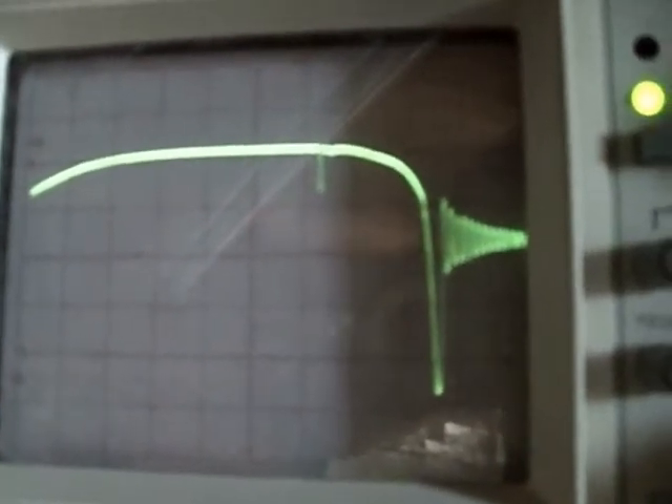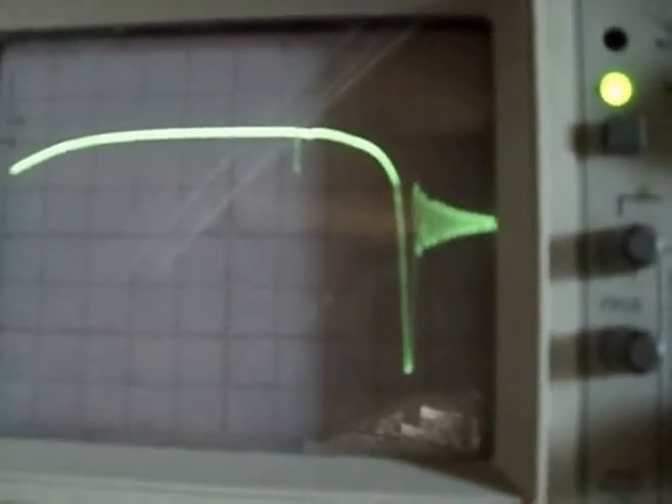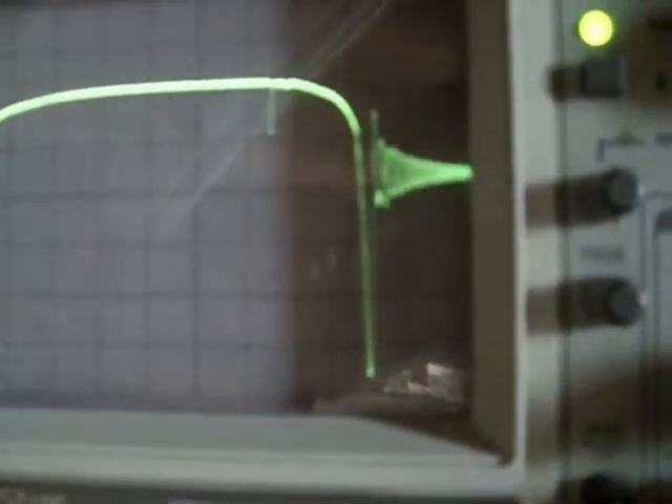What this ringing does when you smooth it out to where you get this real nice ring is that it does increase heat in the resistor. With each test I have done, having this ringing compared to no resistance gives less heat and worse charging with no resistance, but better charging and more heat with ringing. So that ringing absolutely does give higher heat production in the resistor at a lower voltage and current, and better charging to the battery.